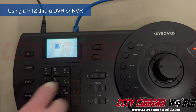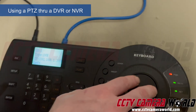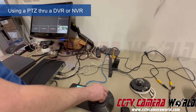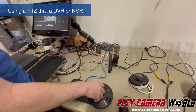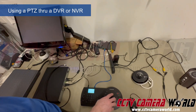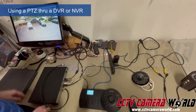We go back to Zone Control. We now have a DVR at ID 1 — we enter ID 1 and press Enter, and it connects to the DVR. If you don't have a PTZ selected, you'll see a different screen on the keyboard, and moving the joystick will just change the views on your DVR. That may be useful for someone attending a security camera system who needs to look at different camera views — they can easily toggle between them using the joystick.